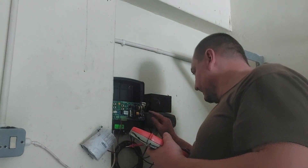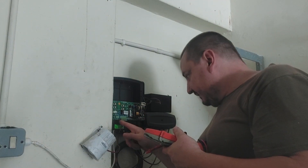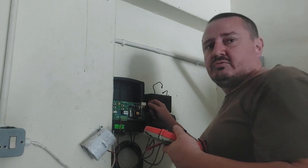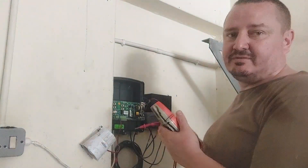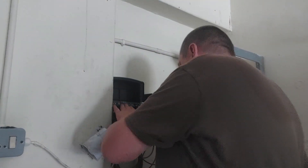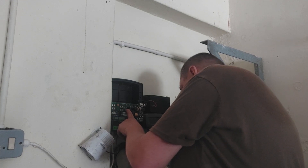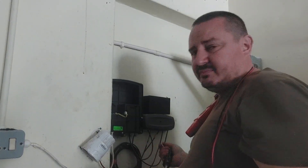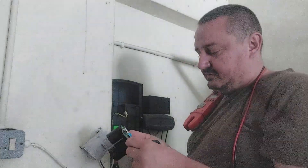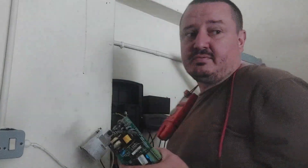So it looks like we've got power coming in — the board does do charging. I do see a swollen capacitor over here which we'll check out on the bench later. We do have our supply coming in and our voltage out to supply the battery. The battery has got some power, so that's good. It looks like the problem could be on this board here — it's not energizing. So let's pull it off and check it. It's nice being able to pull the board out and leave all these fence wires connected. Basically we need to get the power light nice and bright and then we can take it from there. Next step: we go to the lab.